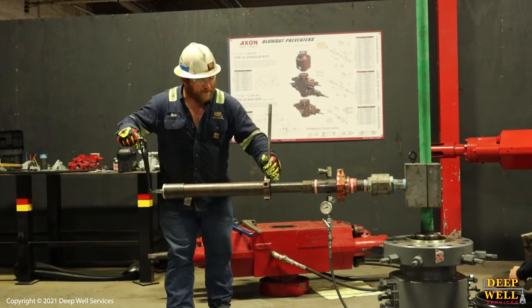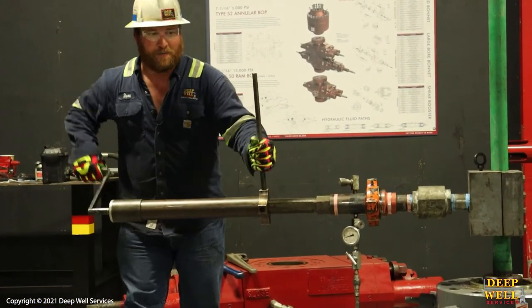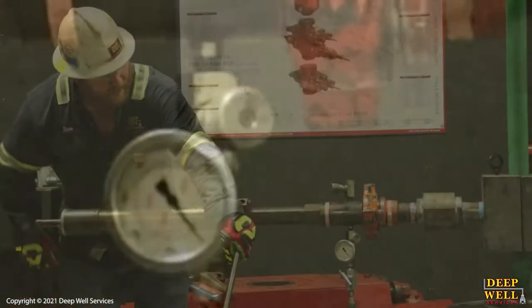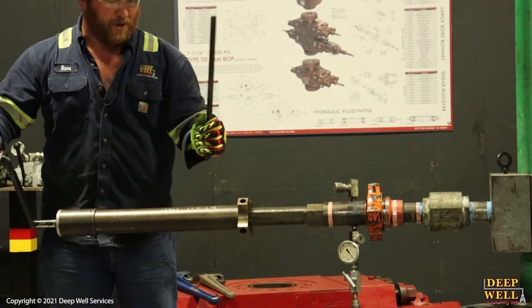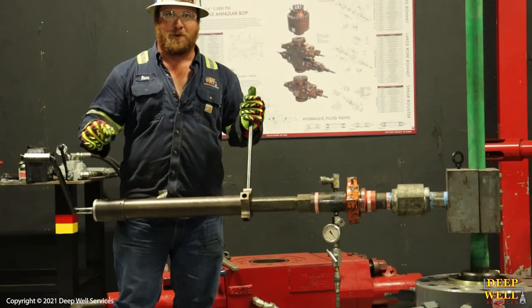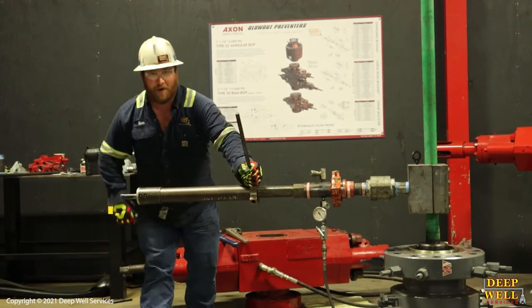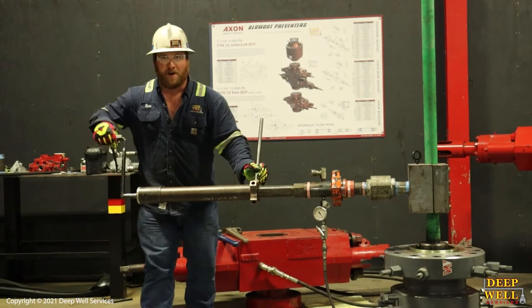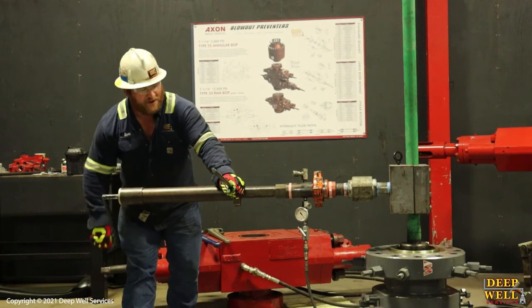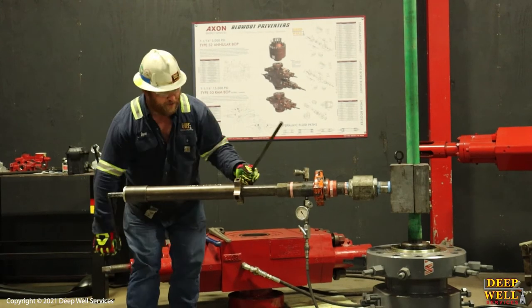You'll know you're through it when the pressure starts to bleed off. Once it's all bled off, that means we're through that joint — but just the tip of the bit is inside the joint, so we don't have a full-size hole yet. You want to continue turning your drill to the right and advancing it until you're completely through the tubing — a quarter inch or half inch more depending on your wall thickness. Once you're completely through, continue spinning to the right and retract your drill bit.